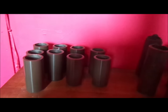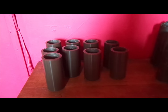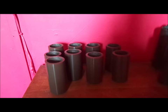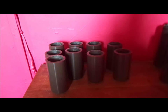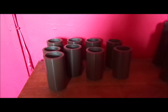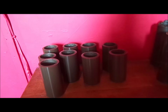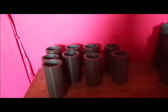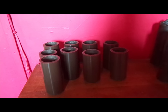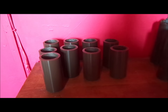Some elements that actually cause problems are humidity, barometric pressure, and the relative temperature in the room, all of which affect how the wax works. The type of mold you use, the materials in the mold, if you have two different metals, all molds require some preheating. A mold that is at 70 degrees, which is usual room temperature, will not yield a very good blank, and usually there are several ways to heat the mold up.